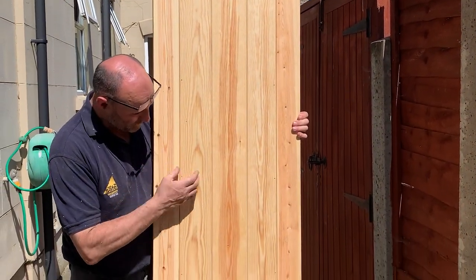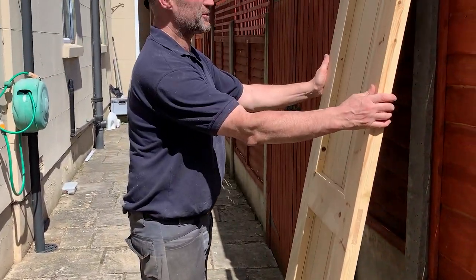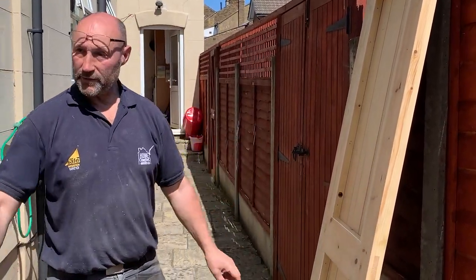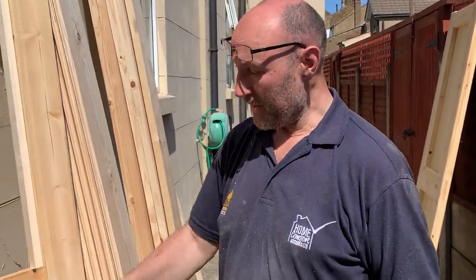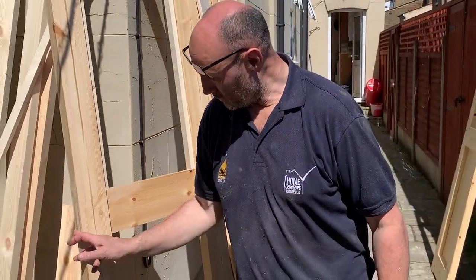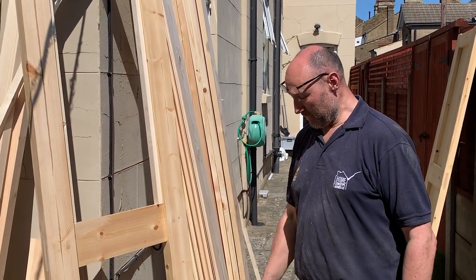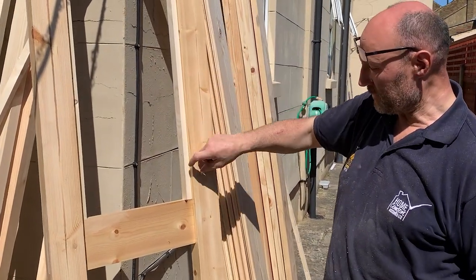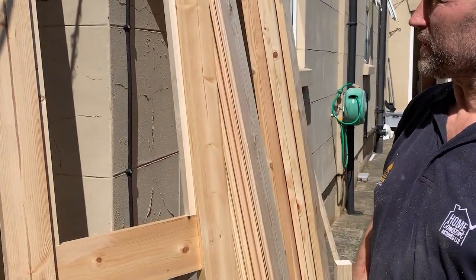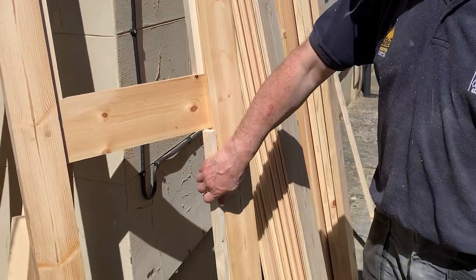You can see the similarity, these bits of wood are a bit wider, not quite the same proportions, but it's the same style. And this is one we're in the middle of producing at the moment. So we've produced all the frame, and this is all hand cut mortise and tenons. And when I was ordering the timber up, I made a small mistake. I didn't order this timber wide enough. So rather than cutting this groove out of the thicker timbers, we're just planting on these infill pieces.